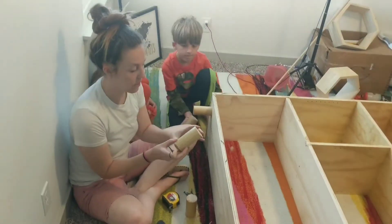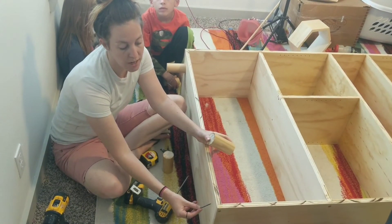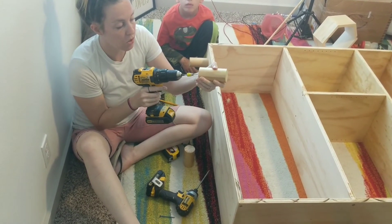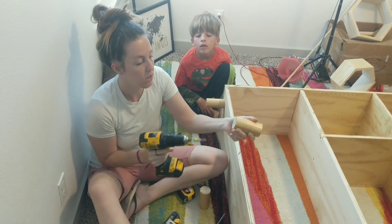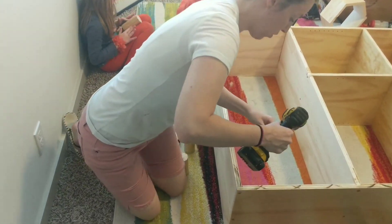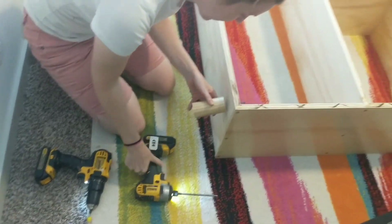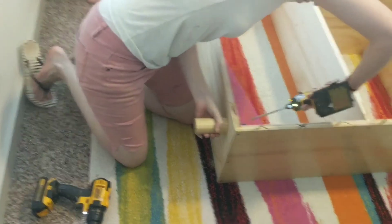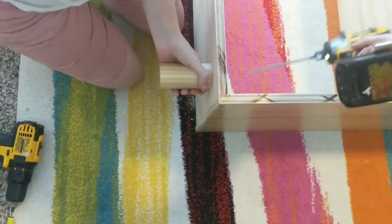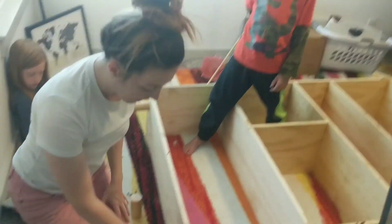I have my five legs cut from the dowels and the way I'm putting them on the bottom is by measuring three inches down and three inches over from the side. I pre-drilled my holes and drilled a little hole down the center of the dowel to give me a starting point. Then I put in my screw, and once it hooks out a little bit I can stick it in the hole I made on the dowel and hold it in place while I screw it in. I counter-sunk it so the screws weren't poking up, since this is where the drawer sits.